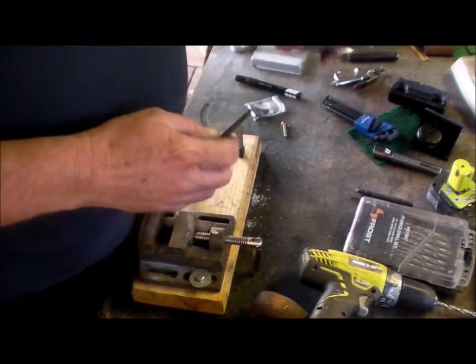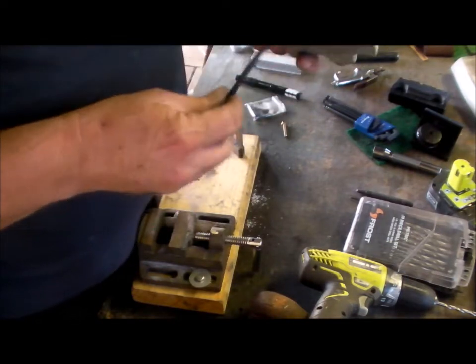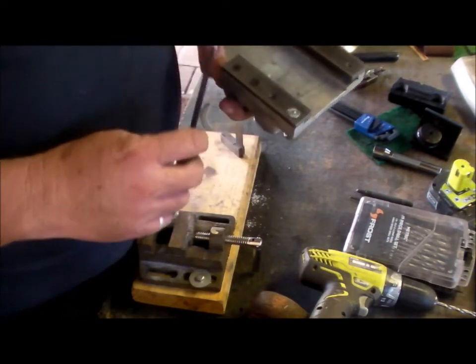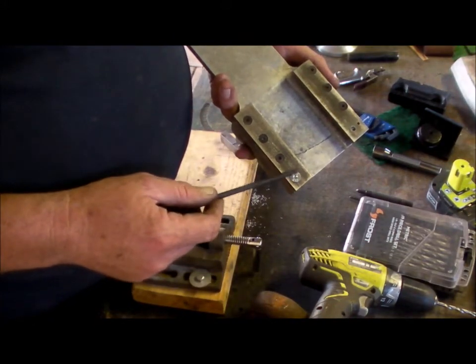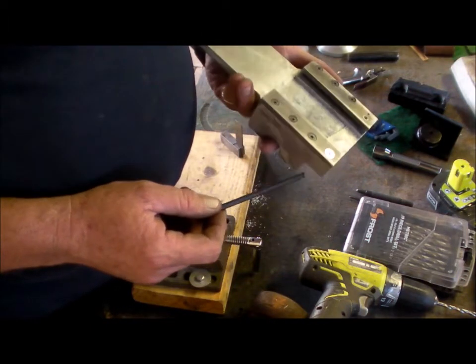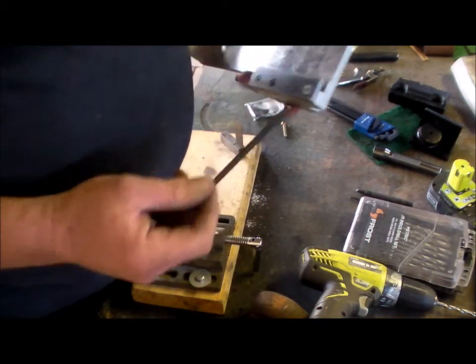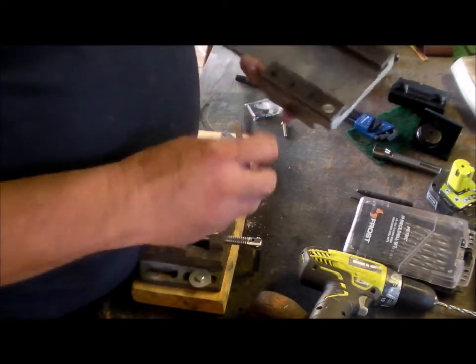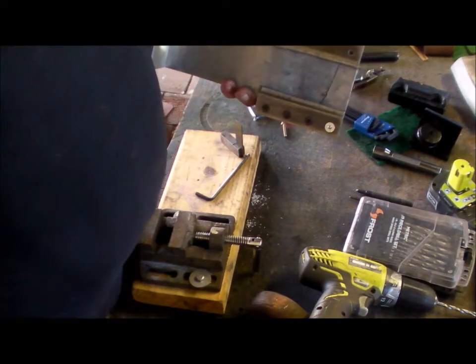It's amazing I didn't make a mistake there, because I did make a mistake when I was drilling this out — I drilled the wrong hole. We've now got a different size screw in that one. These are 5mm; they were supposed to be 6mm. I didn't like the 6mm — the lands weren't that big — but this one's now a 6mm. Anyhow, it hasn't affected the job. Another mistake to chalk up. Alright, go and drill some gib screw holes. Catch you later.